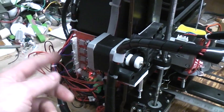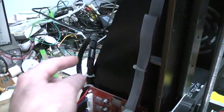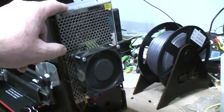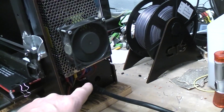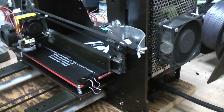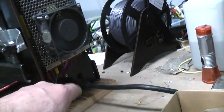That little fan will actually be the noisiest part of the printer when it starts up. Mount the board vertically so you can get into the card slots much easier. Mount your bed, wire it up, drill a hole and use a cable tie so it doesn't hang up. On the power supply, it's easier to flip it over so the connections are down — that way the power supply leads they give you will reach underneath to the board, and it keeps the terminals out of the way so no one can get shocked.